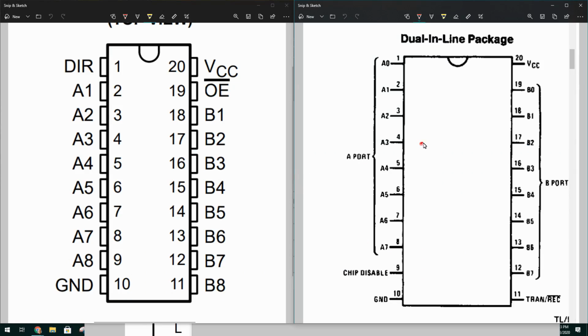So over here on the right, and excuse my crappy writing, is the 8304. And on the left is the much more common, and I'm surprised they didn't use this, but maybe at the time they didn't have it, the 74LS245. Looking at the data sheet, these both basically do the same thing. They're an octal bus transceiver with the ability to switch directions, so it can send the signal from A to B or B to A, or it can disable itself entirely, which disconnects both sides from the bus and goes tri-state. They both do that, but the pinout is just slightly different.